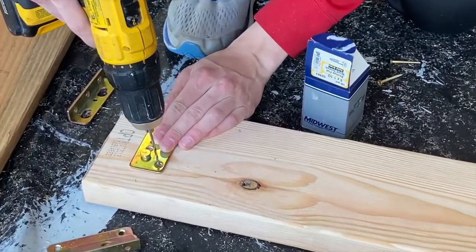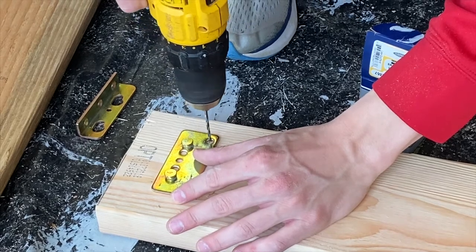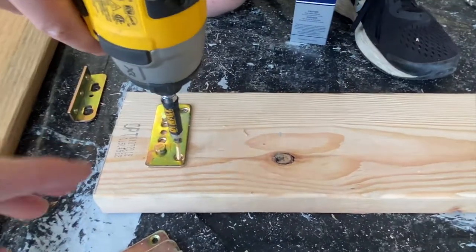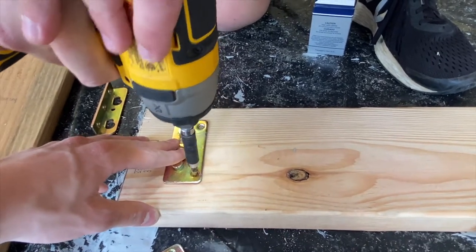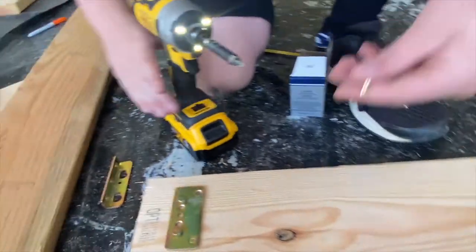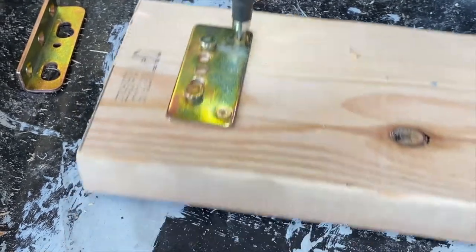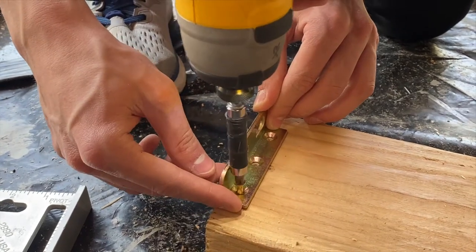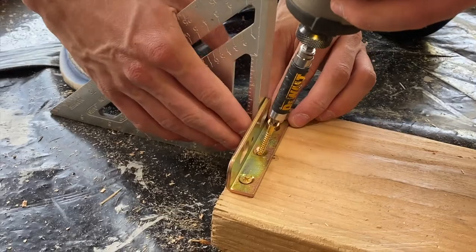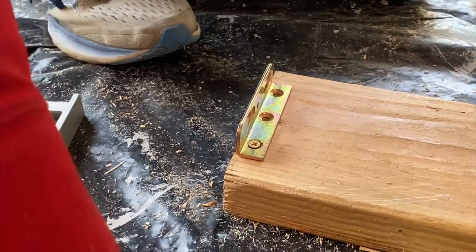Put everything back down and put your brackets in. You want to drill pilot holes — basically drill a little bit in so the screw can go in without cracking the wood or going in the wrong way. I'm using an impact drill here to make sure the screw really gets in there. I would recommend buying one or two inch screws rather than the ones that came with the bracket, because those tend to be unstable and come out easily, especially if you drill your pilot holes too big. Once you put in the first bracket, put in your other bracket using the same process — make sure it's going in straight and not curved.